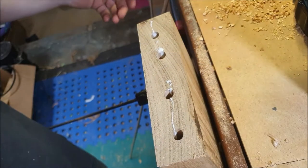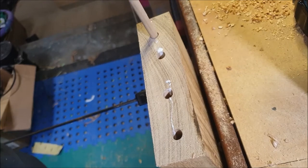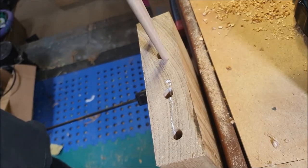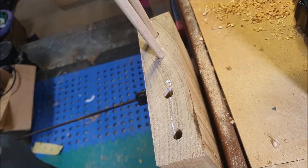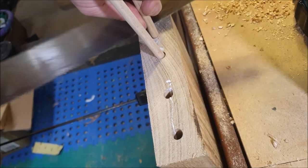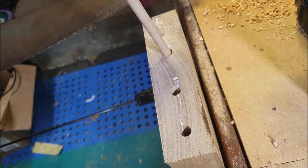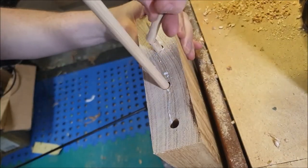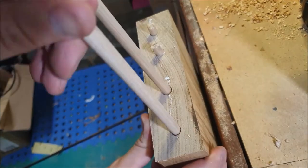You can get a sense here of just how oversized the holes were — only an extra mil or two in it. But that little bit of play was enough that I could get all the holes lined up with the dowels, no worries, but not too much that everything was loose and rattling around. Once the glue had dried in the holes, everything was pretty secure and I didn't have any troubles.